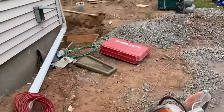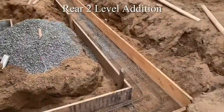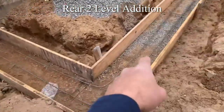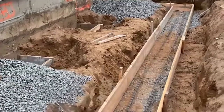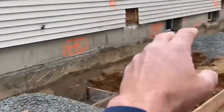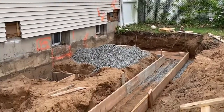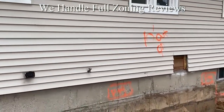Yesterday the excavating crew removed this set of steps, pulled out the slab, and excavated. You can see everything's already in place — we're only about an hour and a half in today, forms are in, rebar is done, it's all seamless. We're going to have this eight-and-a-half-foot rear addition all the way from this corner to about 30 inches in off the corner to meet the side yard setback, then we're going up two floors.